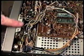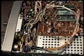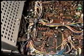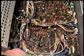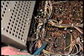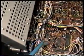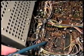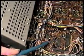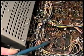All right, we're looking at the front of the radio here. This is the top, the IF board. We're going to swing our top panel open just like we did before. And this is the area where we had looked to see about the lithium battery before. There's the lithium battery. And to access that last 10 hertz digit, there's a jumper that we cut here. And it's already been cut on this unit. But that really doesn't matter because all I'm going to do is show you its location. If it hasn't been cut on yours, you can see where to do it.